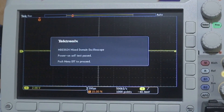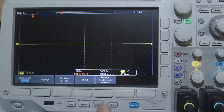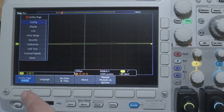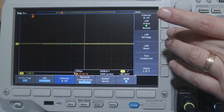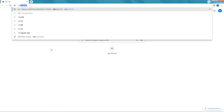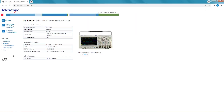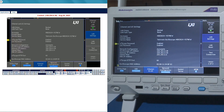So I've powered on the scope, and after the startup message goes away, it comes up and tells us which IP address to use. We can always find this IP address by going to the utility menu, then IO, then Ethernet, and clicking on LAN settings. This will tell us everything we need to know. So we have the IP address there, and we can just go ahead and type it into our web browser — that's 169.254.9.39. Notice that it comes up with the scope and a bunch of information about it. From here I'll go to instrument control, and you'll notice that it pops up the actual image we're seeing on the scope, so we can control it from here effectively.